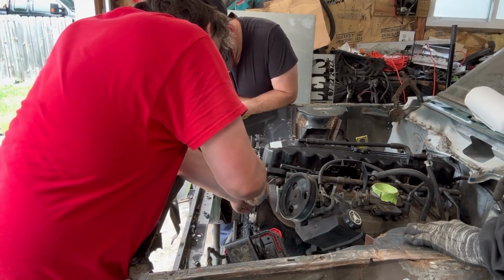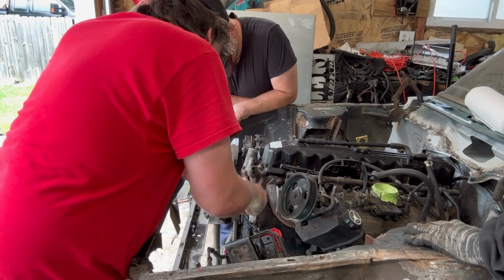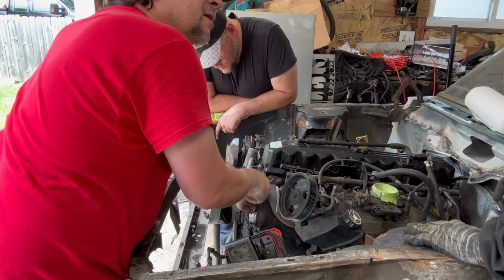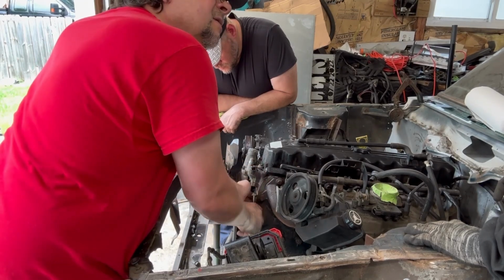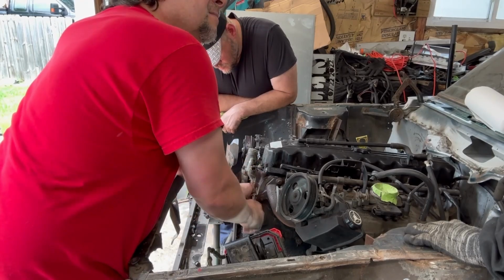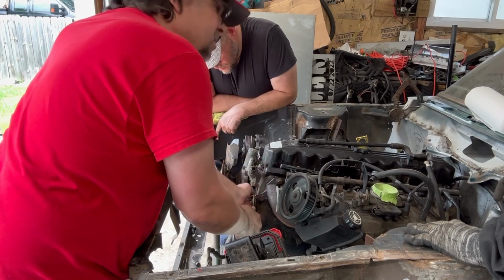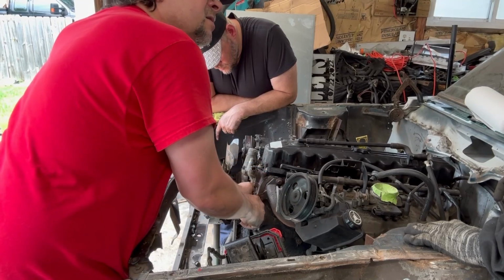You know, rear differential plugs, so they got that crate insert. I stripped one out, and my boss goes, "Yeah, we were waiting for you to do that." I go, "Well, yeah, I could have prevented this." He goes, "Yeah, but we're trying to teach you. Always tighten first. Anytime you have a drain plug like that on an axle or a main trans, tighten first, a quarter turn, then undo." I said, "That doesn't make any sense." He goes, "Yeah, it does."